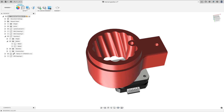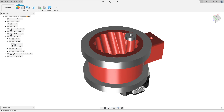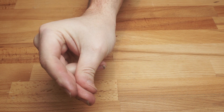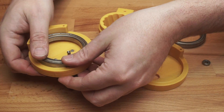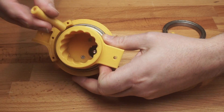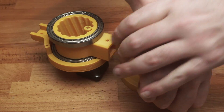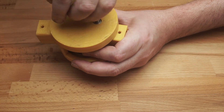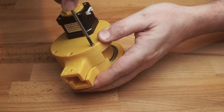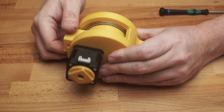So let's do that. I've taken the same sketches and made a deeper set of gears, then added a housing, multiple bearings, and some sockets so that we can put some aluminium extrusion into it. I'll attach the stepper as before, then snap a bearing into place and push the large gear into it. The pinion pushes onto the stepper and another bearing braces the other side of the large gear. A small bearing is pushed with some force into the housing. A piece of 5mm rod goes through the bearing and supports the pinion, and finally we can screw the two sides of the housing together. I'll lube it with PTFE grease off camera.